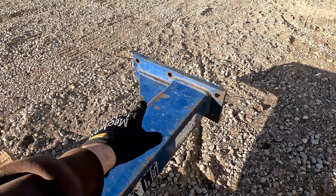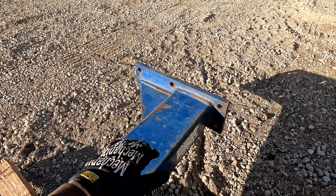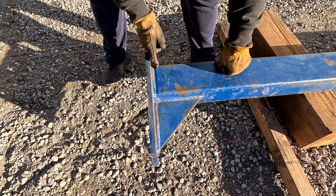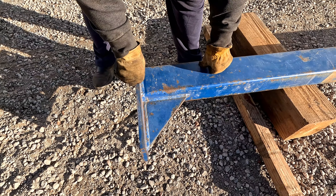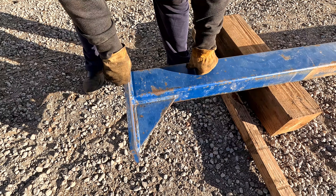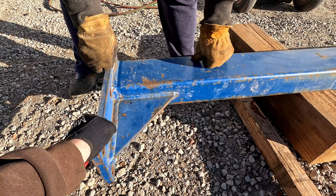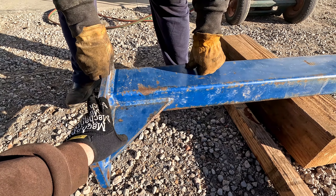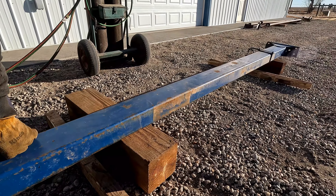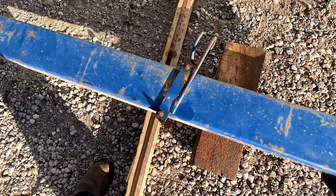We've got a lot of torching to do because we've got to cut these ends off on both sides so that we can have a good straight cut. Don't have to go through this thick part — get rid of the weld. I'll try to cut as close as I can. Because we'll have to weld on that and grind it anyway since our leg's going to attach out here. And then once you get these cut off, we'll find our center and cut it in half. Dad doesn't miss an opportunity to use the torch.